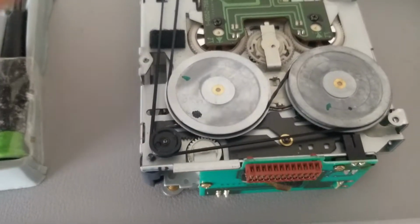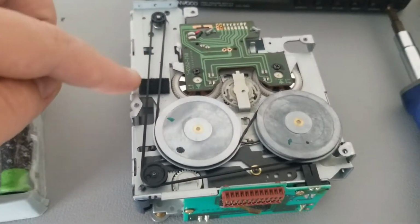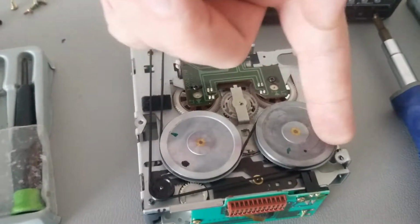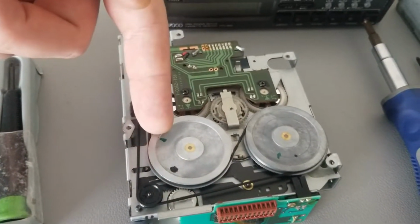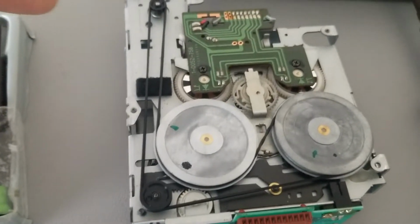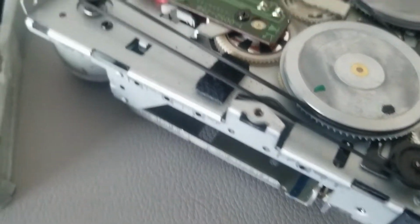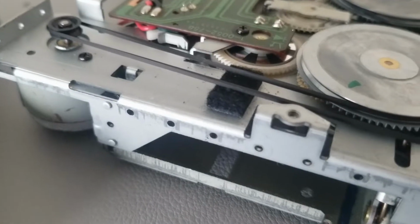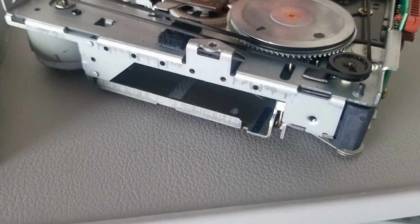Here I have the belt on the cassette mechanism, and it's routed around the black pulleys, around this outer pulley, and comes back on the inside of the inner pulley. What helps me is just getting it routed, and then I worry about flipping the belt and orienting it so that there are no twists after I have it routed. So I'll just go around kind of spinning it, flipping the belt around.